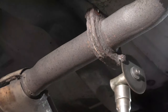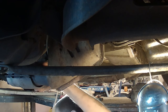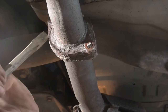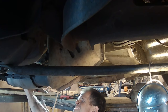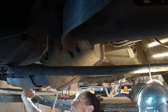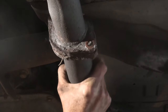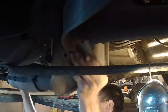Cut the other bolt off the head and get rid of that one the same way. A lot of these air tools I'm using were bought at Harbor Freight or Amazon — I'll include a link in the description. Then grip that one with vice grips and get it snapped off. Now all we have to do is separate it from the H-pipe: tap it here with a little hammer, start breaking it free. Then a little chisel between the flange where the gasket had been — some tapping and it's starting to break free already.